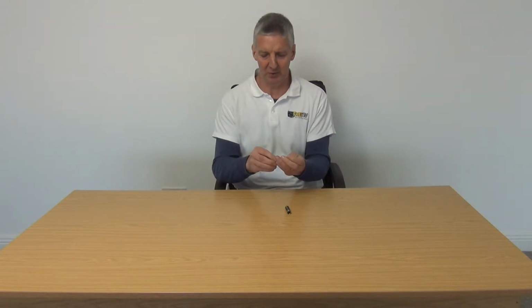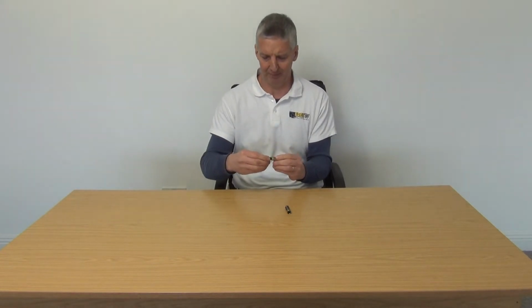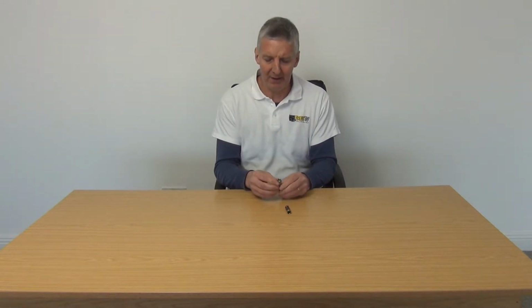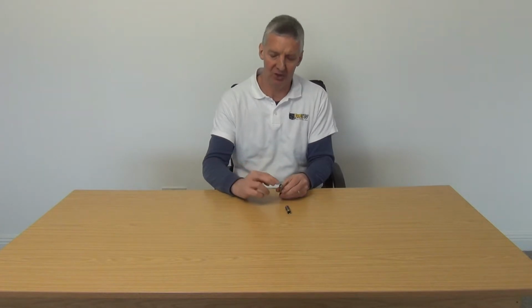Normally, obviously, we have a long length of cable, we wouldn't just be putting on a connector like this. But when we push this in, you push all the way to the top, and you know you've sufficiently pushed it in when the little pin in the center is maybe a millimeter or so shy of being smooth with the surface.